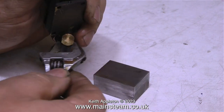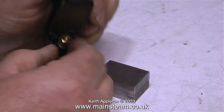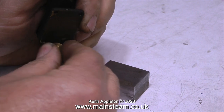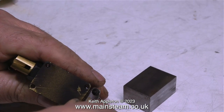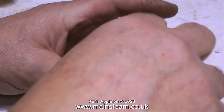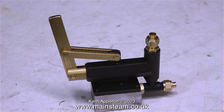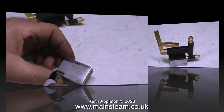The brass plug is a bit too big, so I need to take it out, put it in the lathe, machine a little bit off, and refit it — and then I'll be able to mount the pump on the metal block perfectly. You can see this clearly in this clip: I'll just shorten the end of the brass cap and the pump now sits on the metal block and everything's okay.